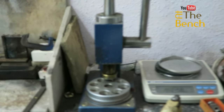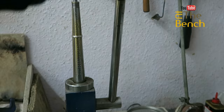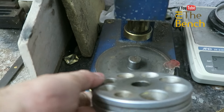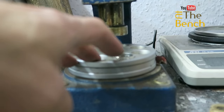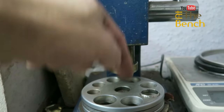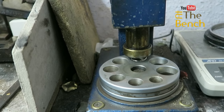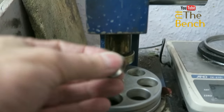So this is our wedding ring stretcher. You can see we put rings on the top here to stretch — the ring goes over, you push the handle, the spline opens up, stretches the band. But also down here we've got these reducing dies. They are simply conical tapers — conical holes, tapered holes. The idea is to reduce the ring: you find one of these where the ring just sits slightly above, and then you turn this round. As you pull the handle down towards you, the rod comes down and forces the ring into the hole. You turn it over, put it back in place, pull the handle towards you, the rod comes down, you push hard, and it forces the ring into these tapered holes and cones. And the ring gets smaller.